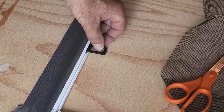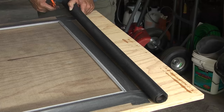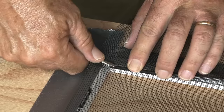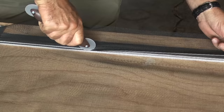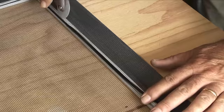Next I'll insert the two pull tabs into the groove on the end opposite from the tension springs. Then I'll take the screen cloth, roll it over the frame and cut it with a pair of scissors. Then I'll take a piece of spline, push it into the groove in the frame and start rolling towards the next corner. According to the spline roller instructions, I should use the convex wheel on the roller to push the spline into the groove, then use the concave part of the roller a second time to go over the spline again.